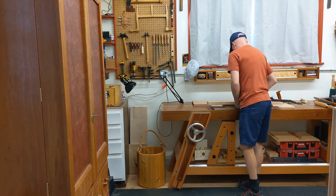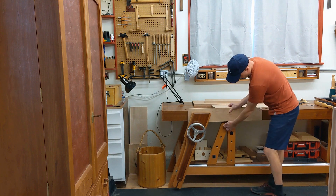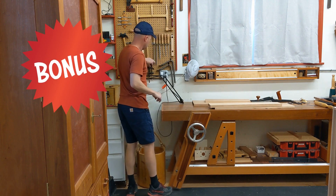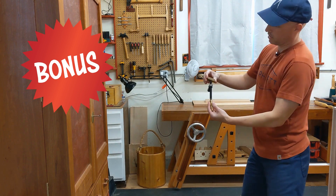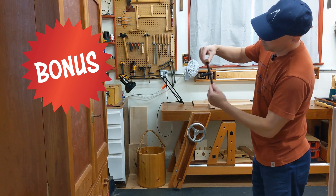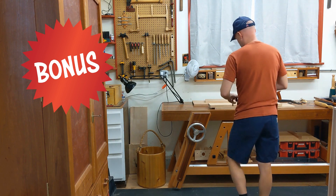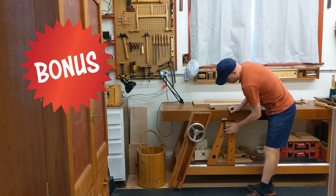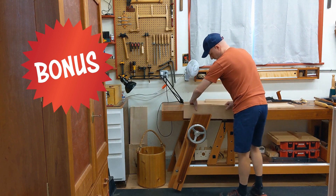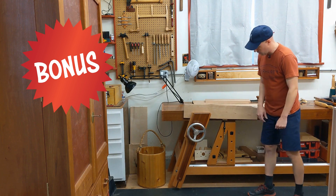Now what if I'm working with a board that is a bit narrow? Say I want to put a narrow board in like this, but none of the dog holes is high enough to really support it. Here's a little bonus tip: you can use something like the Veritas Wonder Pup. This is basically a surface clamp, and if you work with gravity and get a little rhythm going you can adjust it much more quickly. Put that in your dog hole and now you have a basically infinitely adjustable support on your sliding dead man for narrow pieces. Drop that on top and I can work the edges of narrow boards with adequate support from underneath.